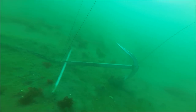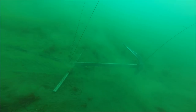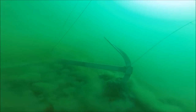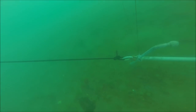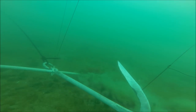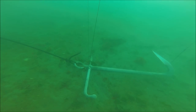This is a 40-pound Luke copy. Luke anchors are a disassemblable version of the old-fashioned fisherman anchor, and this anchor failed to set — not a challenging seabed; we're still at the sandy mud site. It never sets. Here's a 100-pound fisherman anchor — the real McCoy — using nylon rode, no chain, as was recommended back in the day. It does set and holds the boat in reverse thrust of about 300 pounds of pressure.